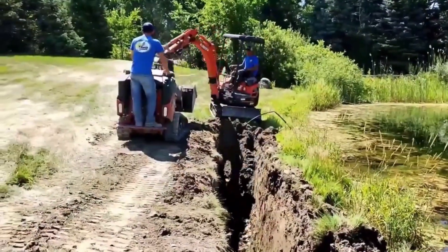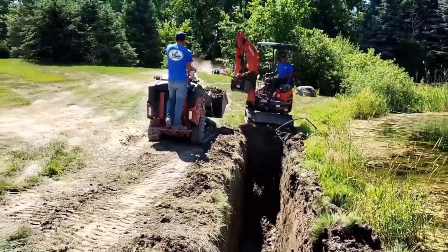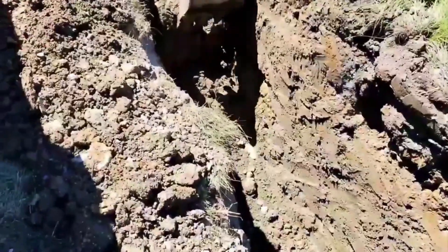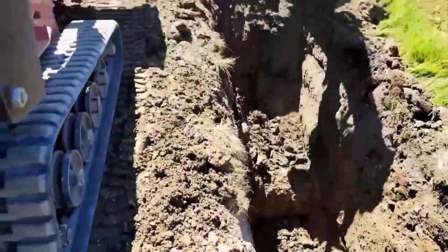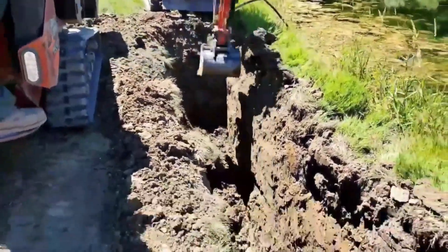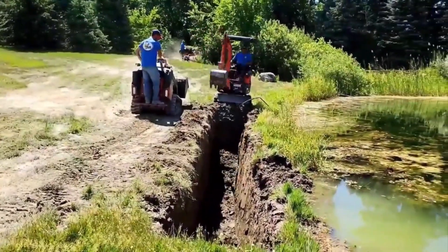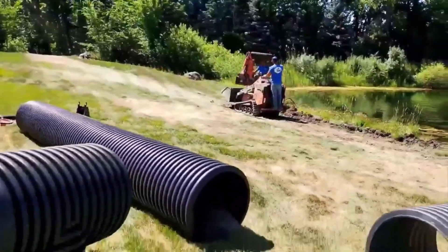So this is the dig and this is clay. We have a pond and the problem is when you irrigate from a lake or a pond, the suction line always gets plugged with seaweed and it's just a nuisance — a lot of service calls. It gets very tiring. So we're going to show you how to build a cistern and it's like a stone filter, so none of that seaweed could ever get into your irrigation lines and no debris off the bottom of the lake either.